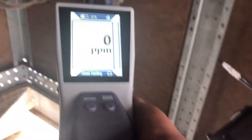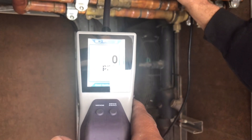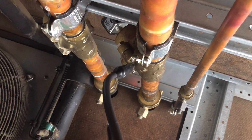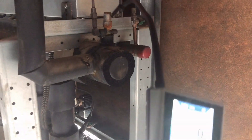Let's stick it in there in the rack room. I noticed a little bit of oil right there, so let's go ahead and check it with our leak detectors. See if the H10 or the Stratus will pick it up. Nothing. The reason we're doing a leak search is because this rack was low on refrigerant and somebody found one of these rotolock fittings had come loose, so they had to add some refrigerant. Now we have to do a mandatory leak search.